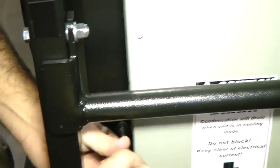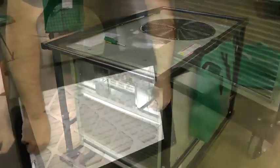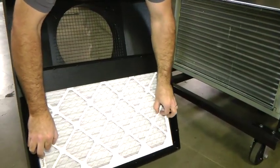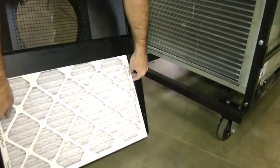To replace the air filter, unscrew the four hex bolts securing the front port cover. Inside the cover is the air filter. Pull up on the filter, then out on the bottom to remove it. Place a new filter in top end first, and push up to fit into place.